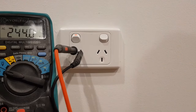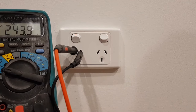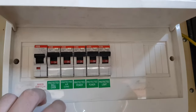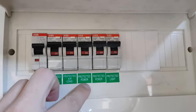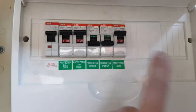You should read between 230 and 250 volts — every house might be a little bit different. So now we just need to isolate this. For your power points you're looking for a 16 or 20 amp circuit breaker. It's a 16, that's a 16 — obviously it says power so I'll just isolate both of those. If you're unsure, just turn them all off.